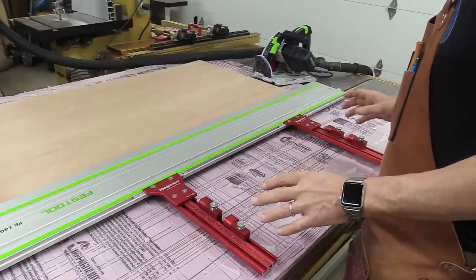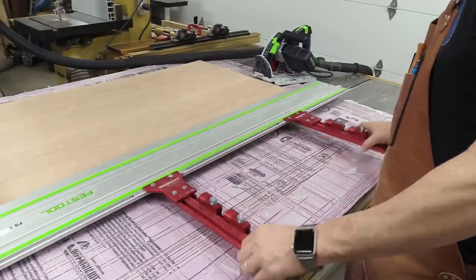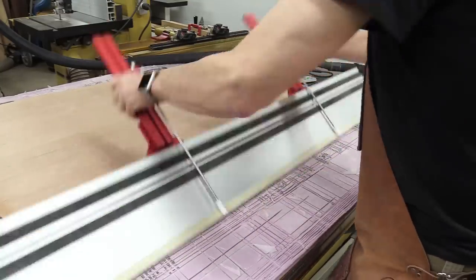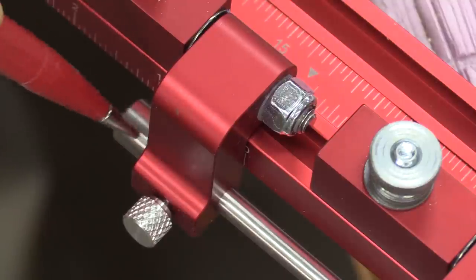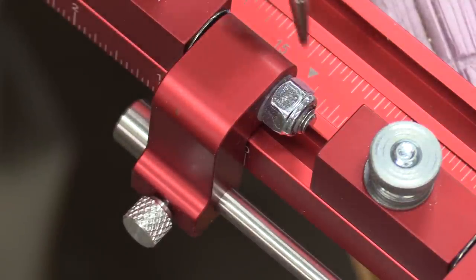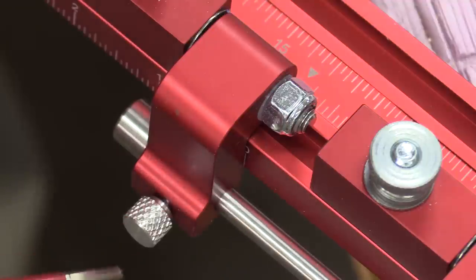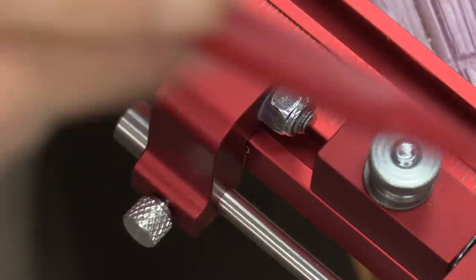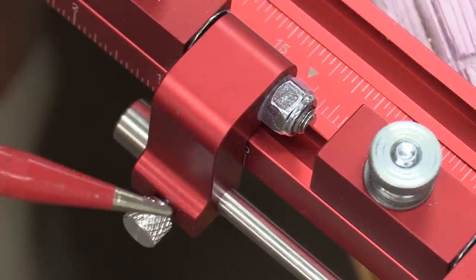There are going to be times when you want to rip thin strips with your track saw — let's say in this case an inch and a half. I've reinstalled these metal bars on the underneath of the rail. The thin rip guide with the end cap butted up against my rear flip stop — I've got this rear flip stop set to that same 14 and 5/8 I used to calibrate it before. If you look on the side of the scale, there's a zero, and that's exactly zero to underneath the blade. So I'm going to move the rear flip stops back to an inch and a half to get inch-and-a-half strips.